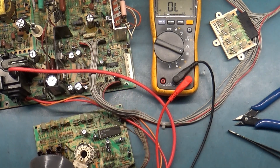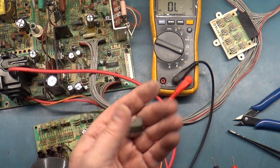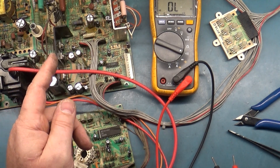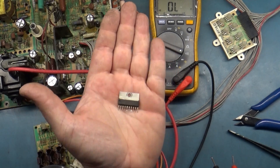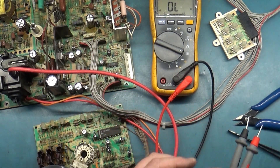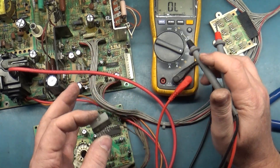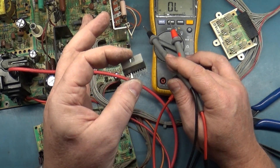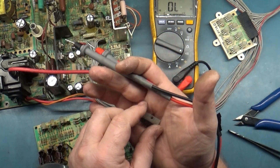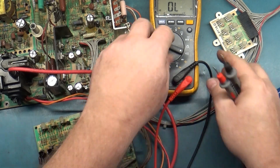It read okay, but was bad. I put a replacement in — brand new, had two in stock — put the new one in, full deflection. So it turned out to be a failing flyback, which I don't think was a contributing factor to the collapse, but the flyback was failing. So we had a failing flyback, original caps needed to be changed out, and a bad vertical IC was the cause of this collapse. It was very interesting because even though we had no inclinations of it being a bad vertical IC, that's where it ended up. One of the telltale signs: if you have your 25-volt reference and you have no deflection, it's a safe bet that you have a bad IC. I'm going to toss the old one in the garbage.